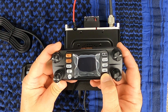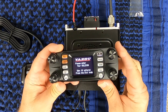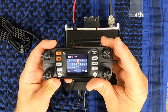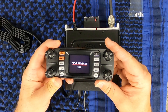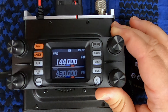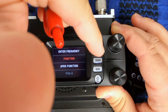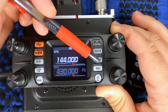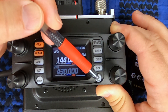The first thing you're going to want to do after you turn the radio on is enter your call sign, but first things first. Once you get your call sign in, push and hold the top right knob and it'll reset. You have the function setup button — a quick press shows you how to enter frequencies, different functions, and APRS. Long press gets you into the main menu. You have your back button, the display button which takes you to the band scope, squelch adjust, power on/off, and lock/unlock.